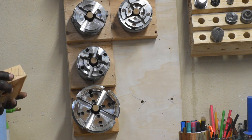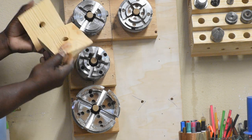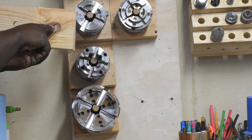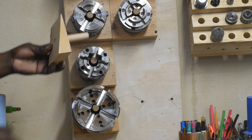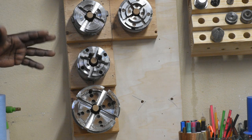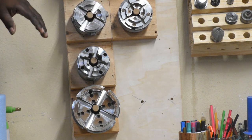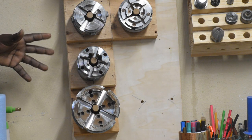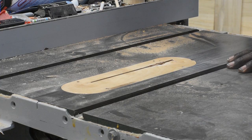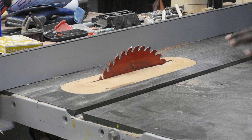Basically the construction goes like this: I take some 2x material, drill a hole in the front, then cut it in half on the bandsaw. That gives me two halves, and when I turn the two pieces around, that gives me two halves with the dowel angled up. You can arrange those on the board however you see fit — you could even incorporate holders for your live centers depending on the size of the board. This is totally configurable based upon your needs. I'm using a 2x6 for the material.